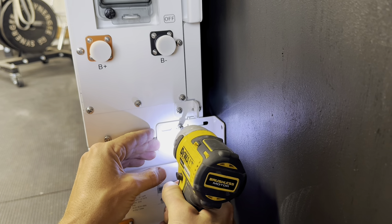The communication cables help the controller — the brains — relay information about each particular battery. As you can see, all the connections are safe for outdoor use. This system allows you to store energy for use when you need it. I'm configuring this system to access energy from the sun, from the grid if I want, and eventually from a generator as well. Now that we've got the connections for the batteries to the controller, this cable allows the controller to communicate with the inverter. These connections will connect the controller — the battery system's actual DC power — over to the inverter for AC use.